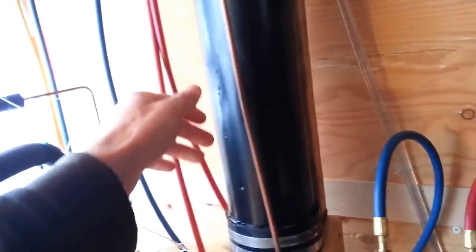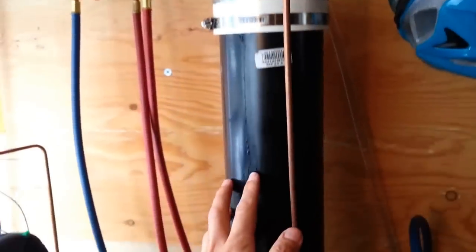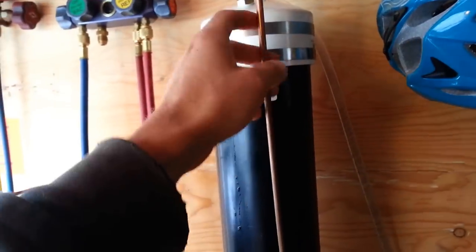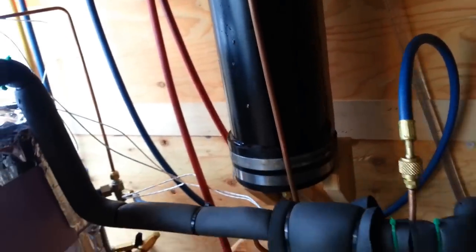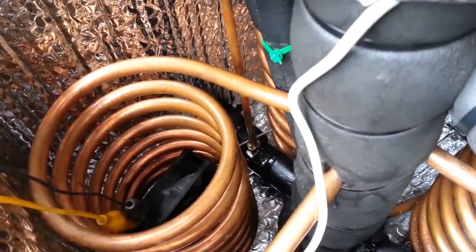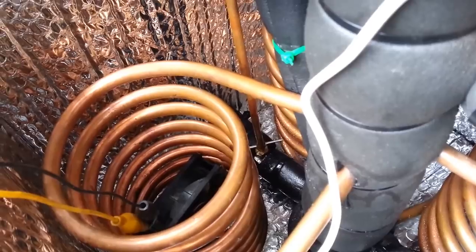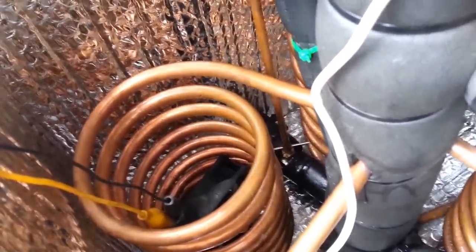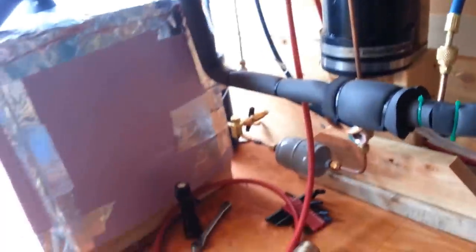Then we have this condenser — it's an important component here. This thing's filled full of water, and this copper tubing runs down through that water. That copper tubing is going to discharge heat — it's going to be warmer than the water inside, and it's going to actually get pumped back to this bucket. After the condenser, we have this valve. It's my throttling valve, my refrigerant control. It pretty much controls the temperature of these coils here. It's one long circuit, one loop — it just keeps recycling this refrigerant over and over again.